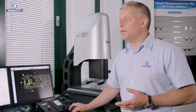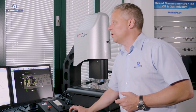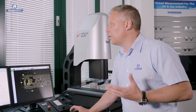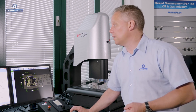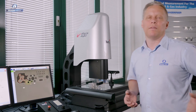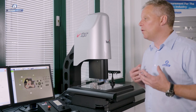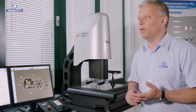The process we've been through — using video edge detection tools to automatically find edges, taking lots of data points, creating a drawing, dimensioning the part, scanning and best-fitting to DXFs, and generating a report — has real value because this is a CNC system. Hitting the play button, the software has remembered everything I've done. We've got a program to measure this part — what we call the teach-and-repeat programming style. I haven't had to program anything or touch the keyboard, yet we've created drawings and reports and we're measuring a part automatically.